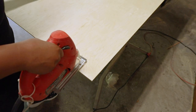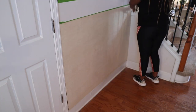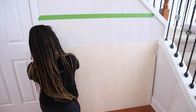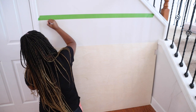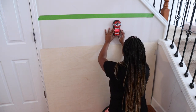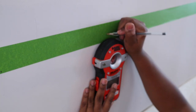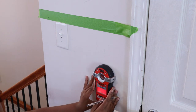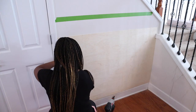There are several different ways to make this renter-friendly. After I got the piece cut to fit, I used my stud finder to find the studs to nail the plywood to. I decided to nail it to just a few studs so I'd be able to pull it off the wall later and putty the nail holes. Another option is removable mounting tape, but you have to know your walls — I knew that on mine it would rip the paint right off, so nailing to a few studs was the better choice.